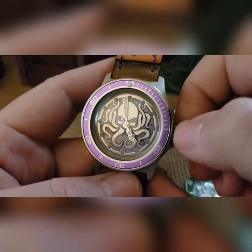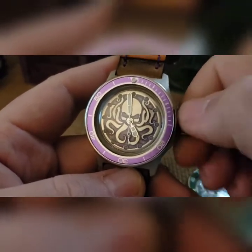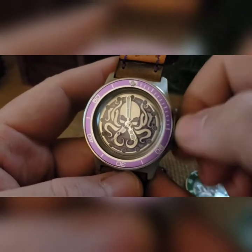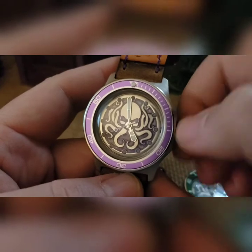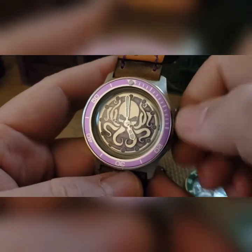The wind direction is backwards, and going the other way doesn't hurt it. Keep fingers spaced off of it and go back and forth. About four seconds of winding before you put it on will keep time throughout the day even if you're not very active. About 20 seconds will max out the 31-hour power reserve so it's ready for the next day. You cannot overwind it.